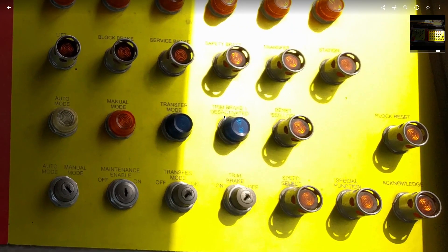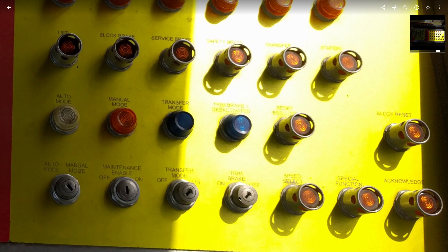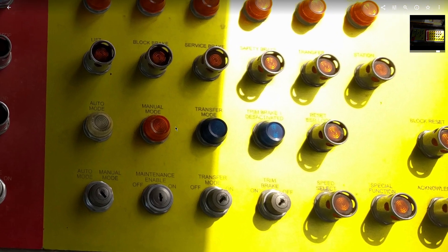These two buttons might be of interest — it's actually not what you think. When you see this, you might think it's that terrible trim brake everyone complains about on the camelback, but it's not. That's trim brake two. Trim brake one is actually the brake at the top of the lift. According to the manufacturer, if a train gets stopped on the lift and has crested over but hasn't gotten far enough to go all the way over, you turn that brake on to hold the train in place while you get the people off so it doesn't go over with the change in weight.